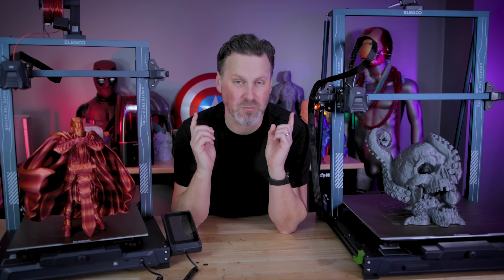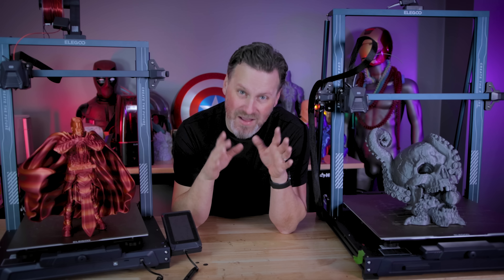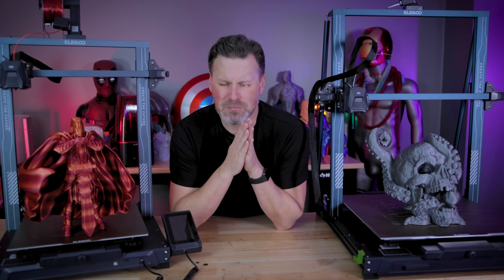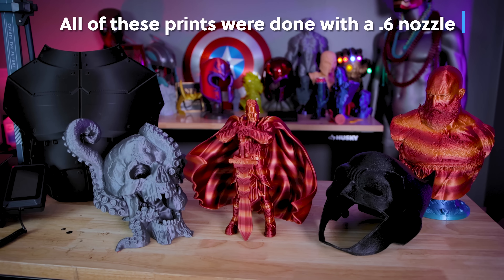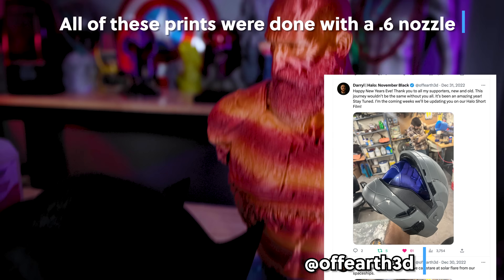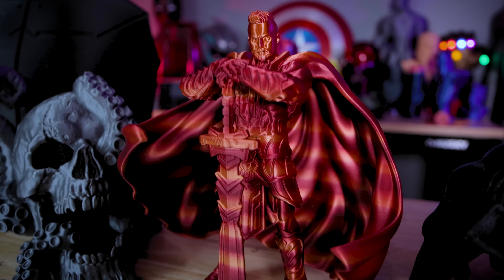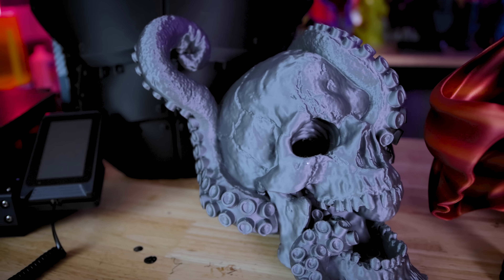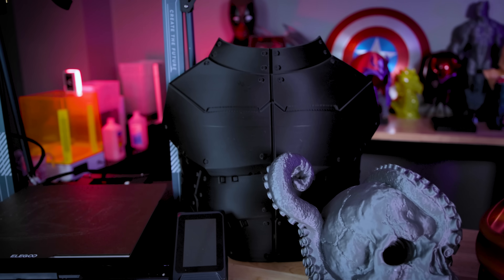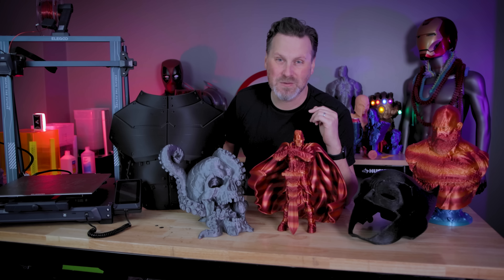In the next week or so you're going to see some really large prints coming off the Neptune 3 Max using either a 0.8 or one millimeter nozzle. I can't even believe I'm going to be trying that out — it's going to use so much filament and I'm basically going to be maximizing the entire build volume of this printer. It's going to be stupidly large. Let me know what tips you might have for printing with large 3D printers. A big thank you also to Off Earth, who turned me on to printing with a 0.6 millimeter nozzle a handful of years ago — it's been a big game changer, especially for larger cosplay pieces like helmets or armor. You really can't tell the difference between a 0.4 and a 0.6 millimeter nozzle when printing at a 0.2 layer height.